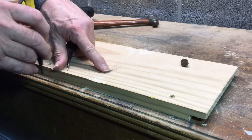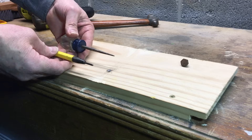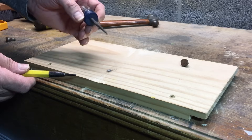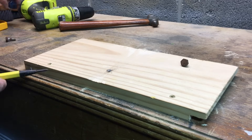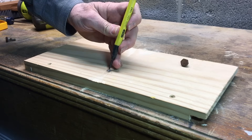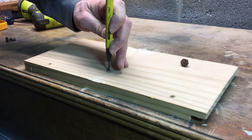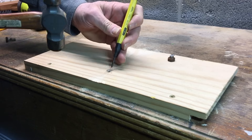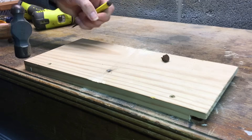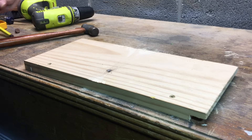What we have to do here is put a dimple in the metal. Just for reference, this is a center punch. This is an awl — much softer metal. Don't use one of these to hit metal with because you're going to bust up the point. So we're just going to take this, set it in, give it a whack, and we're creating a dimple so that the drill doesn't wander when we start.